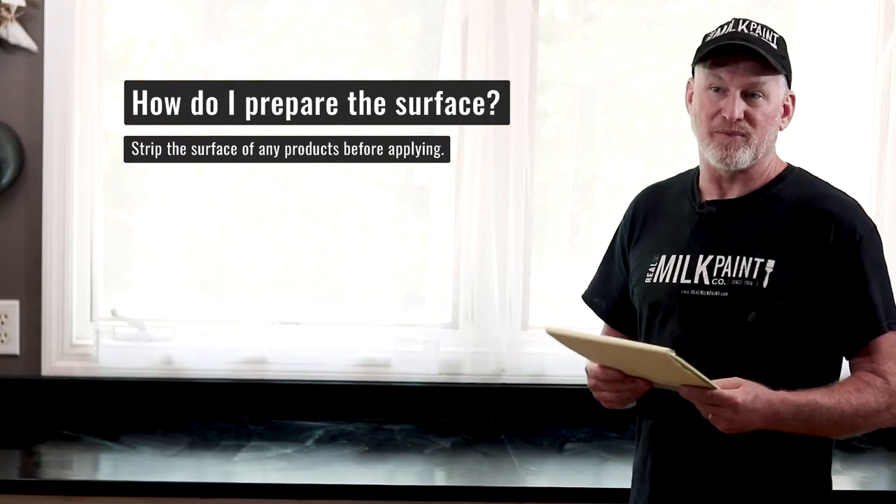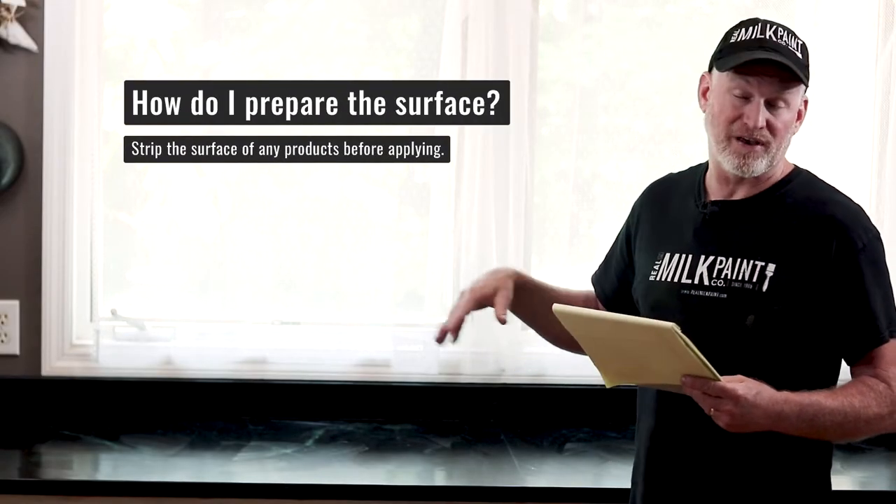How do you clean up and prep a countertop? If you have a countertop that's already been oiled or treated with another wax product, it's about stripping it. You can strip it with ammonia, paint stripper, citrus solvent (a natural solvent we carry), lacquer thinner, or acetone — basically anything that gets you back down to a bare bottom surface with nothing on it.